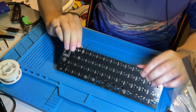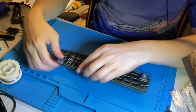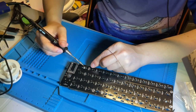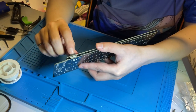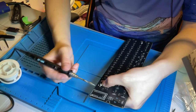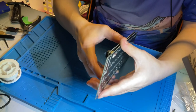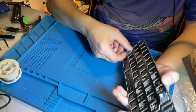What I typically end up doing is soldering once I have some of the core ones in — probably the two corners as well. I solder a single pin of each. After finishing that single pin, it's pretty typical that the switch is not actually lying flat. To fix this, pick up the whole thing, press firmly, then reheat. Keep pressing firmly, release the heat, let it cool, and it should be nice and flat. You can do that with all the other pieces. This is a technique I picked up from Wildcat.